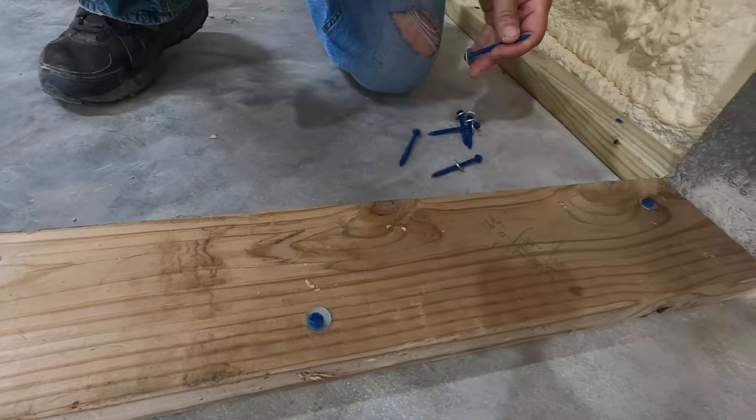So at the top of this, we're going to have to put some galvanized J-channel. And we're going to put that around the room first, and then we'll start putting these roofing sheets on. You probably can't see it, but we've put a blue chalk line that goes all the way around the room so that we can put this on straight.